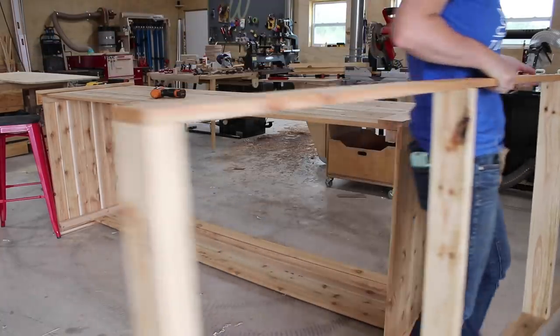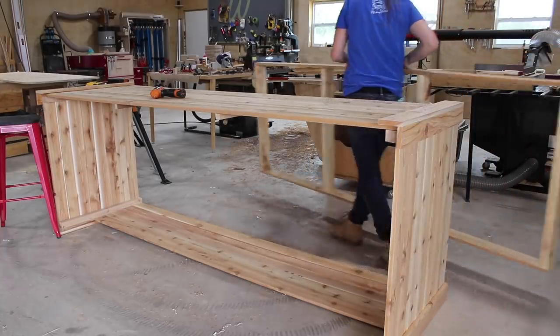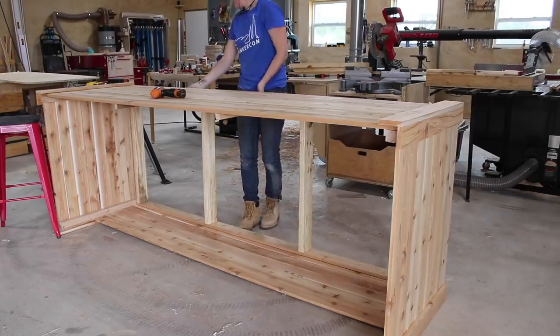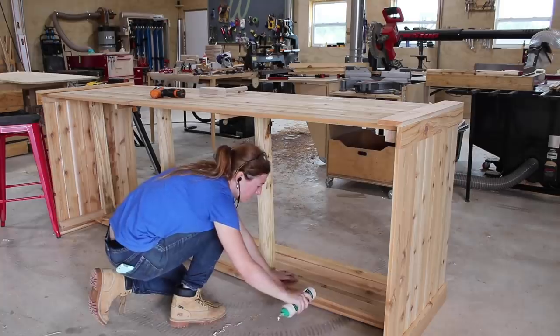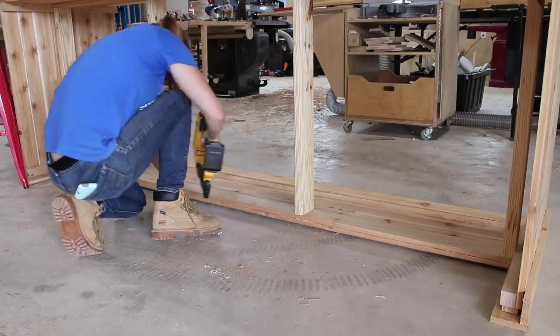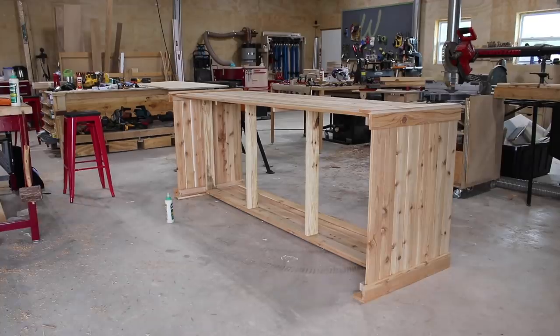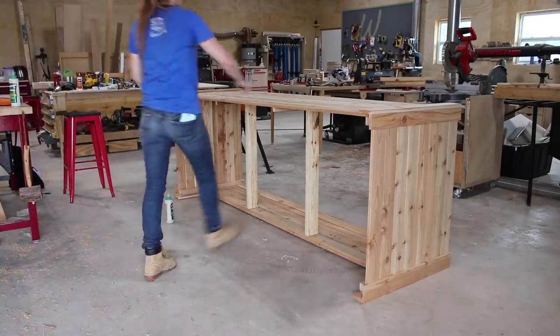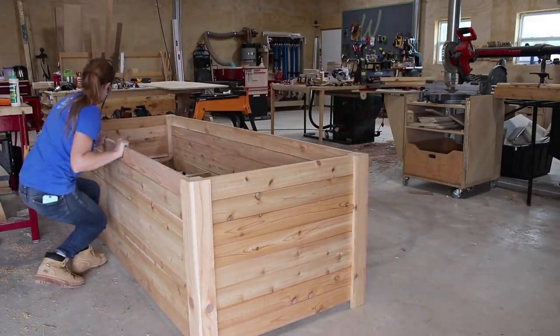Now to fit the frame inside the planter — I built it outside and then inserted it to avoid having screws on the outside of the slots. I shimmied it in place, then backed it out slightly to lay down some wood glue, and used a brad nailer to clamp the boards in place while the glue set up.